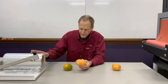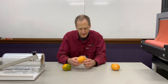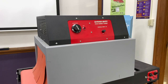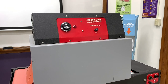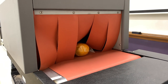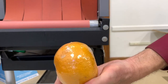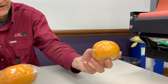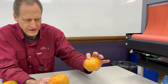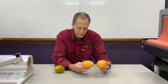After we place the citrus — whether it's a satsuma or a navel orange or a grapefruit, whatever we have available here in Louisiana — we wrap it in a heat-shrinkable film and then pass it through a heat tunnel. After a couple of seconds, it's fairly hot, maybe about 200-300 degrees. The film actually takes the shape of the citrus itself, creating a nice glossy cling-type conformation — like a second skin — and that will basically eliminate weight loss, allowing the citrus to be stored for many, many months.